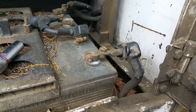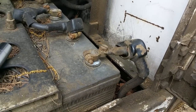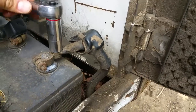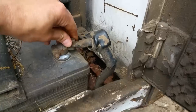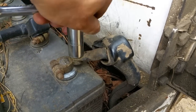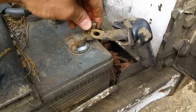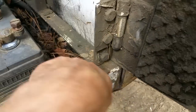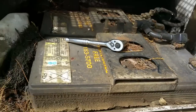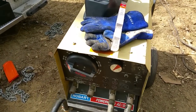Welding is an electrical process, and batteries involve electrical processes. So whenever you're welding equipment or welding on something that has electrical circuitry running through it, you always want to break the electrical circuit. So we're going to disconnect this battery here. I just want to break the circuit so that we don't energize the system with our welding apparatus, because we would most certainly fry the entire system — I'm confident of that. And we don't even have a complete circuit to these batteries here. Today I'm going to be welding DC positive at around 75 amps, and we'll see how that works.